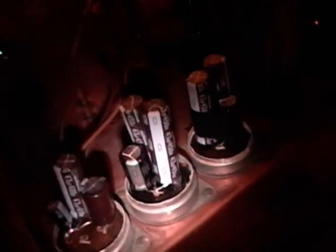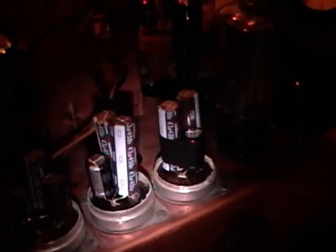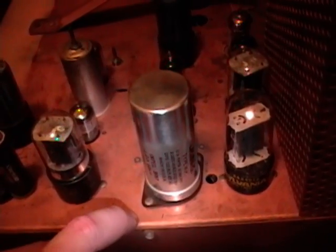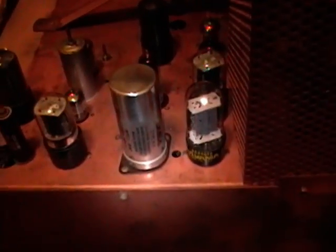So if you need to restuff some capacitors, you can either do it the quick-and-dirty way — cut it off with a jeweler's saw or hacksaw and restuff from the top down — or carefully unsolder the wires, untwist the tabs, remove the cap, and restuff it from the bottom up. Hope you enjoyed this little video on restuffing capacitors.